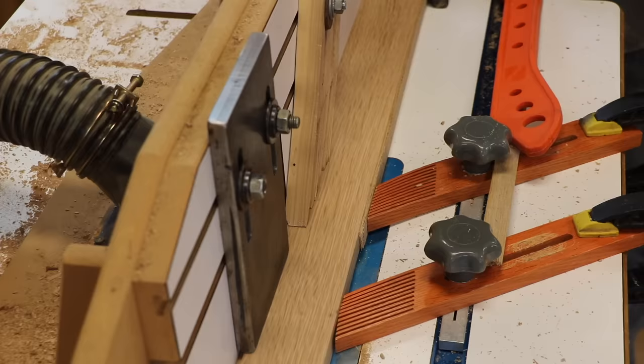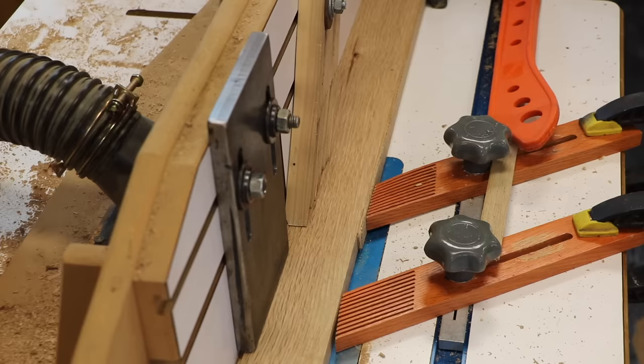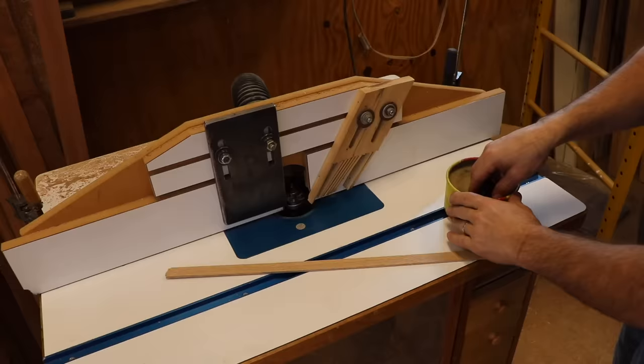Because there are no butt joints in my floor and the flooring is full length, the width really doesn't matter. When you have a floor with short boards and butt joints, all the boards in a row need to be exactly the same width.